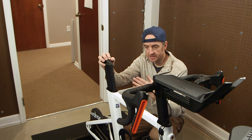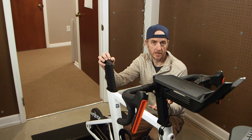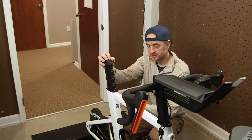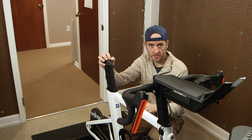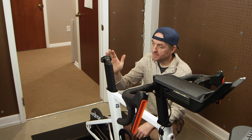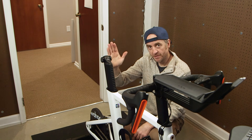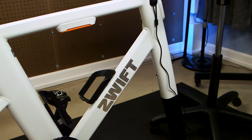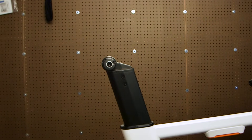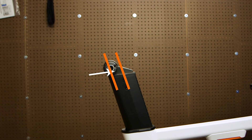What we liked about it is that it's adjustable and we can use one bike for both of us. The only downside we've run into with this bike, despite it being really well designed and really adjustable, is that the saddle setback is fixed. Not only is it fixed, but it's pretty far back — pretty aggressive. So for me it's perfectly fine, but for my wife, who's quite a bit shorter than I am, it's a little too far back.